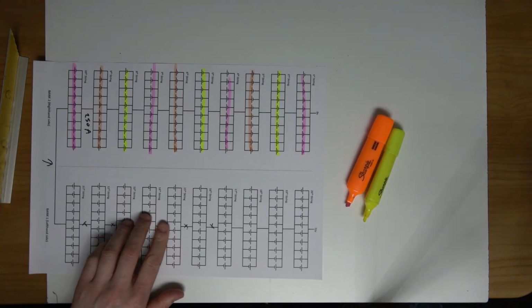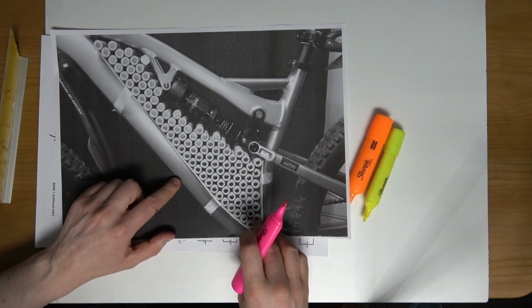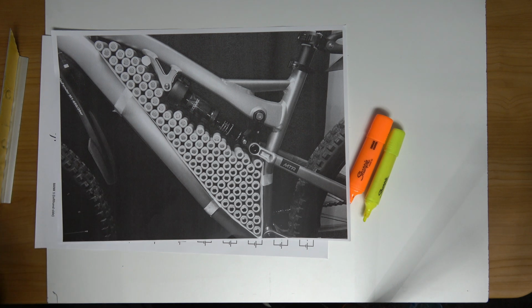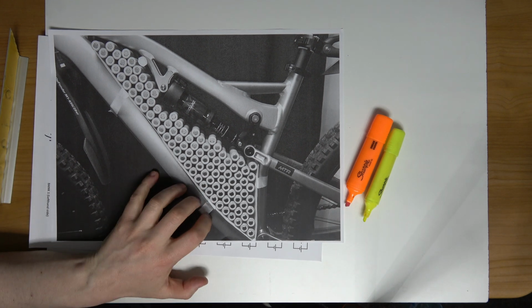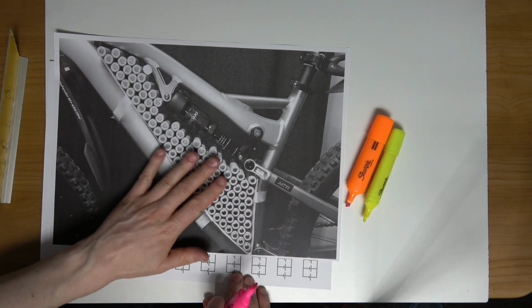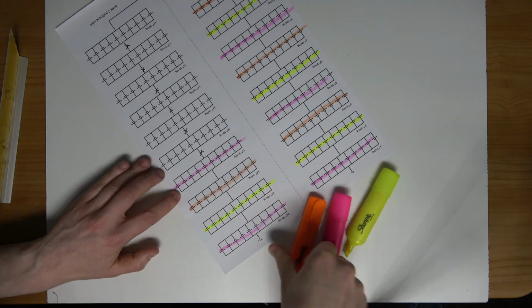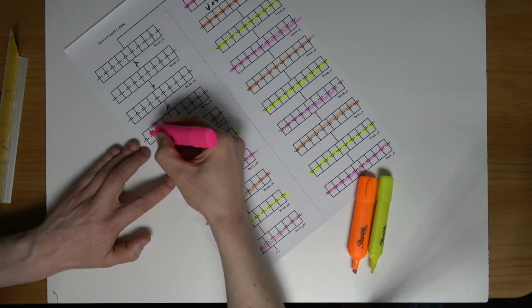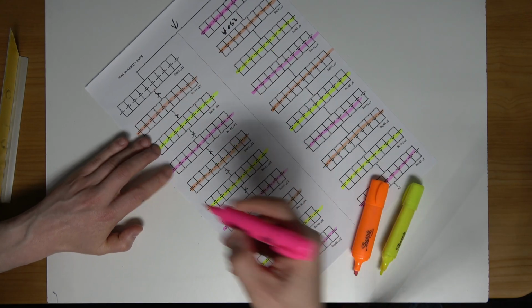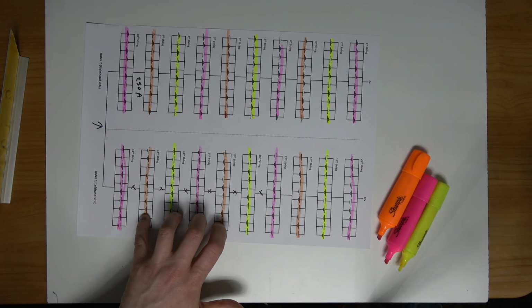So what I'm going to do now is move over to this printed image of the bike. So just ignore the position of the polarity. I'm only using this to configure the pack. So when I go to build my pack, I will turn the cells to follow the instructions that the plans I now create. So I'm just going to mark this side too. So you will see why I'm doing this in a moment. Trying to keep this simple. Make it easy to understand here. Okay, so I've marked out my different groups now. So there's 20 groups, 20 parallel groups.